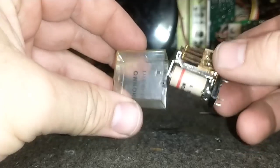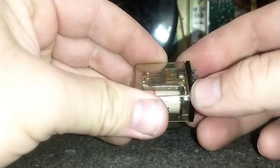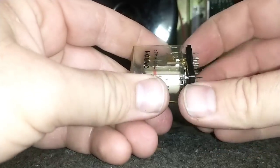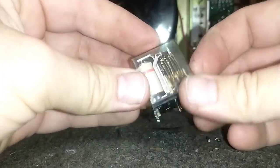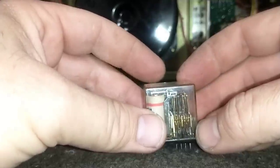Now what you can do is a little bit of added protection — you can spray a tiny little bit of DeOxit onto the contacts and then work it just a little bit to clean up any remaining gunk. Then we'll put this back together. It appears I got it in backwards — you can only put it in one way. There we go. Back in it goes and we'll solder it up.